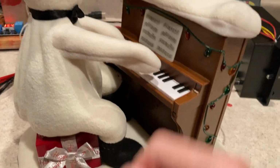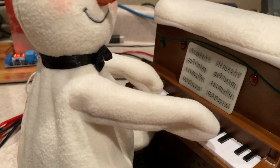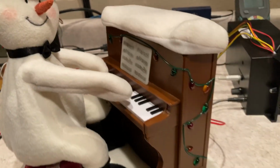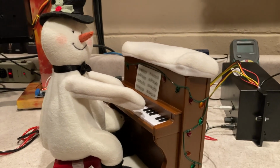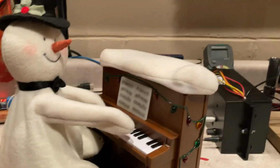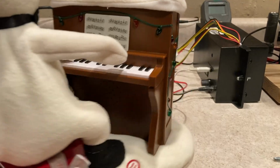If it slips, if he gets over to when he turns and acknowledges he's done, if the motor gets stuck there and he doesn't make it back, then it quits moving altogether. It won't do anything. It's got one of those poly belts on there, I'm sure, and it slips. But I just thought it would be fun to tear it apart. But I actually had to do a motor teardown. I take the back of that motor off, clean all the grease off the commutator and the brushes, the whole thing, and put all that back together.